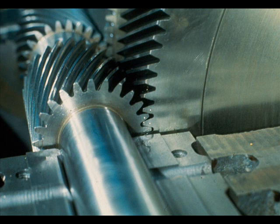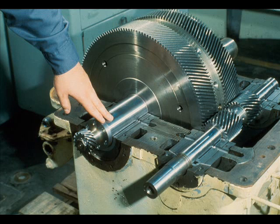Before removing the gears, be sure that the pinion gear is matchmarked with the gear wheel, or as it is sometimes called the bull gear, as is being shown here. If the gears are not matchmarked, then do so. And mentally note or mark the gear as to its orientation with the gearbox — in other words, which end goes where?